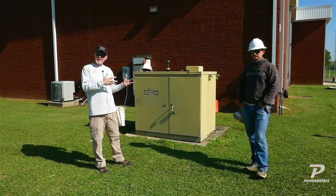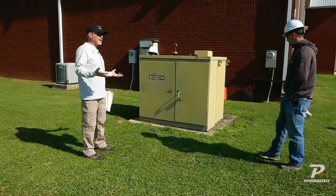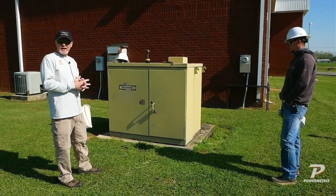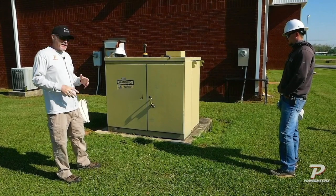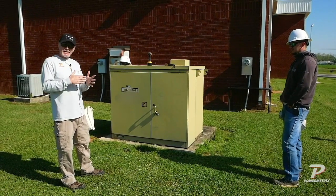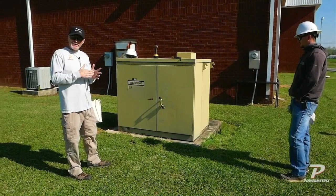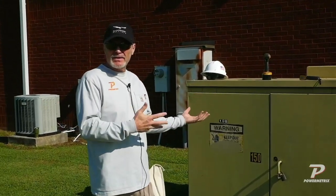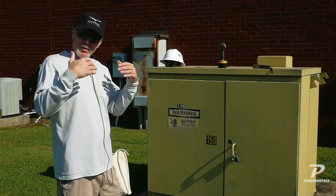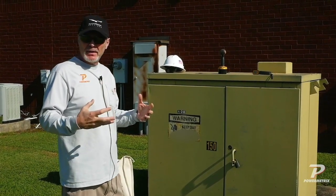The things we look for first: we don't smell anything right off the bat. We're trying to smell oil, which would be something to report back to somebody. Remember, the meter techs are the eyes and ears of the utility on a continuous basis at these sites. They're dependent on us to give them reports of what's going on. We might need to get a line crew to correct, modify, or repair it. The person who sees these things regularly is the meter tech, not the lineman.